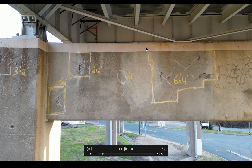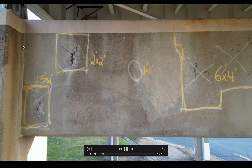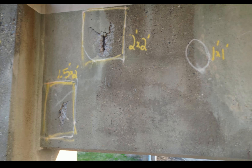At one point it looks like they did attempt to stop the water with what I'll call a silly band of paint. Instead of painting the entire structure to protect it from exterior water — the reactions would still happen internally with the concrete itself — they did this silly cap and called it a day. That's financials. I don't know if this connection is locked or not, if it's moving properly. It's a very lightly loaded structure at this point. Here's your cap coming across that way, and we'll find more coming down and patterning this way. The bridge is acting as a tie directly — acting as a tie also — providing shear stabilization.